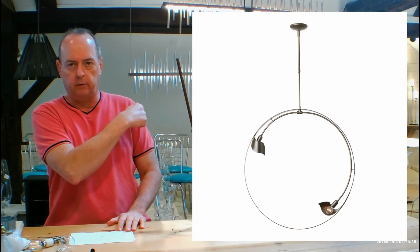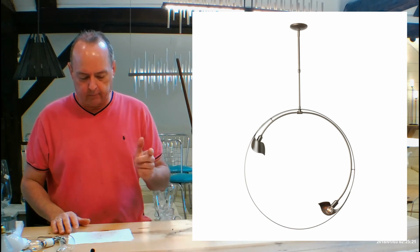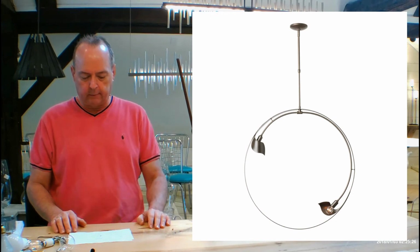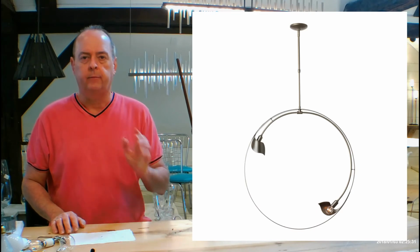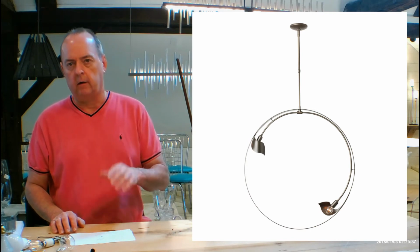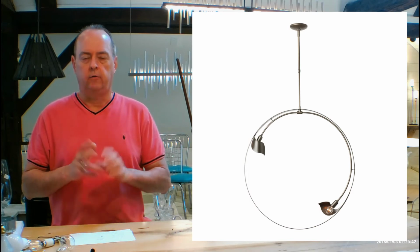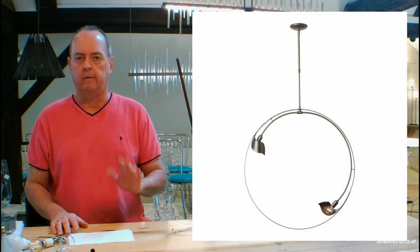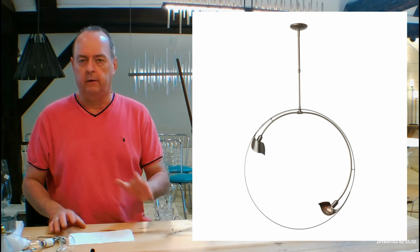So now when we're talking about overall height, you're going to have 3 different ranges up in that pull-down menu when you pull it down to choose from the bottom of the fixture to the ceiling itself. So the short is going to be 45.2 to 51.4. Standard is 49.9 to 58, and the long is going to be 58 to 65.4. If you need shorter than the short, so shorter than 45.2, or longer than the long, from the ceiling down, don't forget to the very bottom of the fixture, 65, longer than that, drop me a quick email, sales@HandmadeInVermont.com. We do custom lengths every day. Adds a little time, adds a little money, and unreturnable, but it's easy to do.